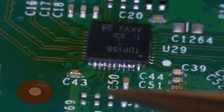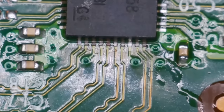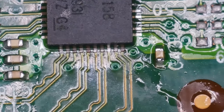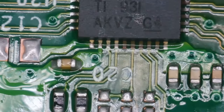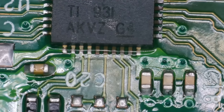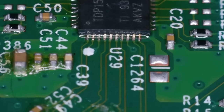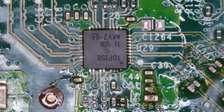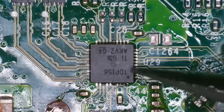How are we looking? You don't actually look that bad. They've put the chip in the correct orientation because you've got the dot here and the dot on the board as well — so that's pretty good. That side is okay. Doesn't seem to be any mishaps over here from what I can see. You don't have to have the joints joined, by the way — as long as they're connected on the underside, you should have no issues. Maybe there's not enough solder. Just checking the final side — there's enough solder here, but the other sides I'm not too sure. I think our best bet here is first a clean up, so we'll take our hot air gun and give everything a nice clean. Then I'm going to reflow the chip, push it down, and go around the edges to see if that makes a difference. It's very possible that this is actually a bad retimer chip — it's highly likely, but I'll give it a chance.